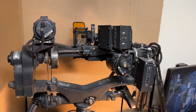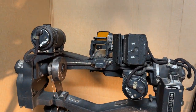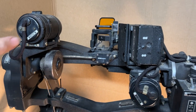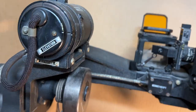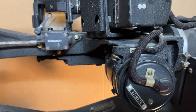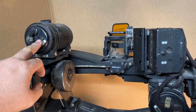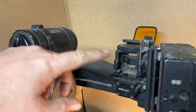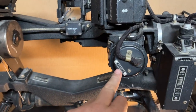It weighs every bit of 50 pounds. What it does is, first of all it has gyros or gyroscopes. These gyroscopes feed information to a computer either via this one for elevation or this one for azimuth, which is left to right and up and down. The earlier type sighting stations only had one gyroscope, which was called a free gyro, and the gyroscope did both elevation and azimuth. The more accurate type is caged — this one is caged only to elevation and this one is caged to azimuth.